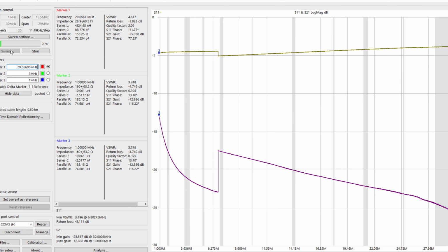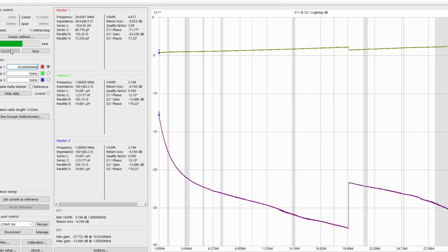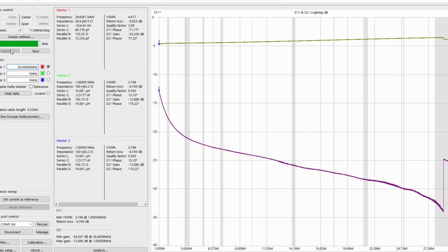Oh yeah, that's a very noticeable difference. Look at that, just doubling the ferrites. It's almost a direct relation: by doubling the ferrites, you double the rejection. Or it seems that way. That's a lovely, lovely graph to see. Now I'm wishing I could find my homemade choke using a ferrite, but I don't know where it's at. I looked for it. I can't find it. But that's really telling how well these inline ferrites do.